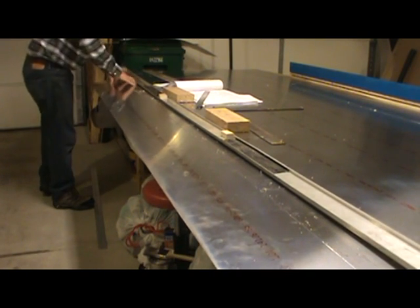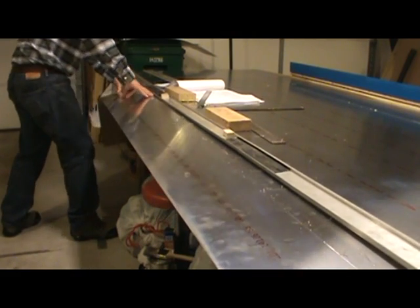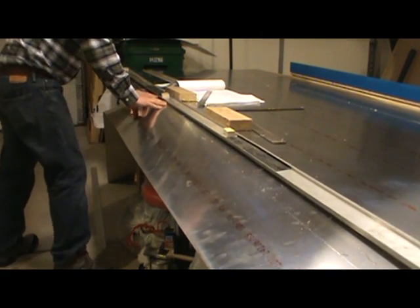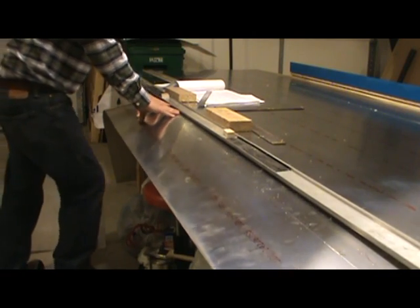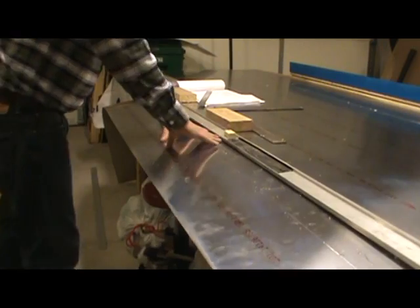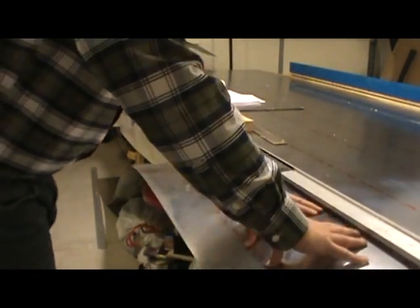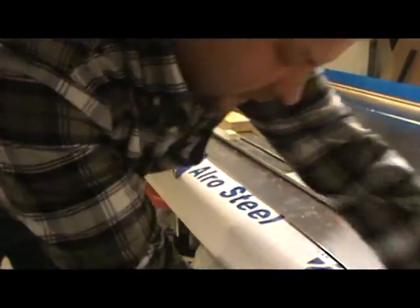You can see it's actually already starting to break off. Normally this would actually fold right up against the table, but because I scored it enough, it's tearing off like it's a pair of shears — except for a few places, most likely. I don't want to get too aggressive with it because I don't want it to buckle and kink.